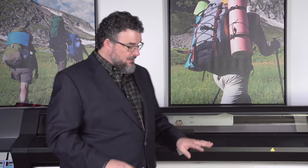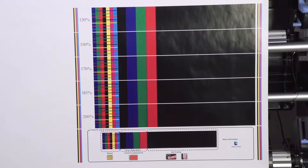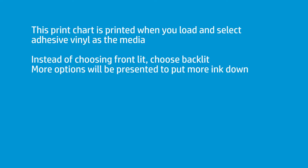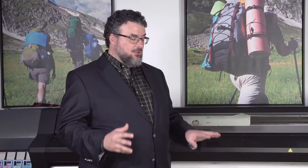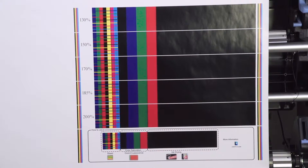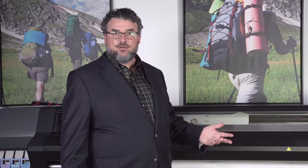What I have here is a print chart. This is just like our traditional speed chart, or temperature/speed/ink load chart, except the difference is when you load the media and tell the printer it's adhesive vinyl — like creating a new media — instead of telling it that it's a frontlit, tell it it's a backlit. You're going to get this chart. This was printed at 12 pass, and it gives you an option from 130 percent to 200 percent. This is giving me a much wider range of ink — it's putting more ink down. Obviously, 200 percent ink is twice what 100 is.